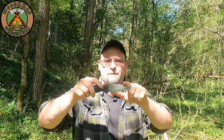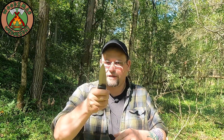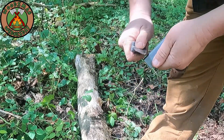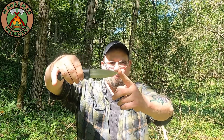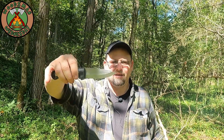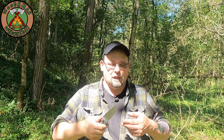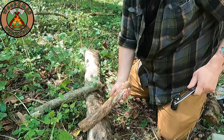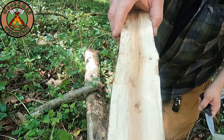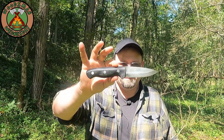It's made from O1 tool steel with a black canvas micarta handle. It's an eighth of an inch thick with a 90-degree spine so that it can shave kindling for fire starting, but it also strikes a good spark from a ferro rod, which we'll see in a second with a mag bar. It has a saber grind and a nice drop point — I like this point. It lets you do a lot of fine work yet still retain strength for things like batoning, and the shape allows you to bore holes with it really well. This is designed to be a tool.